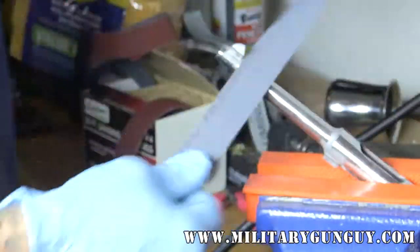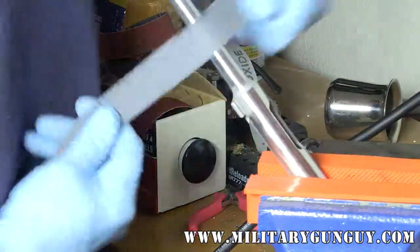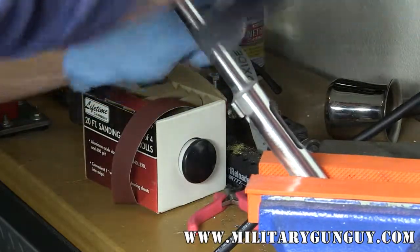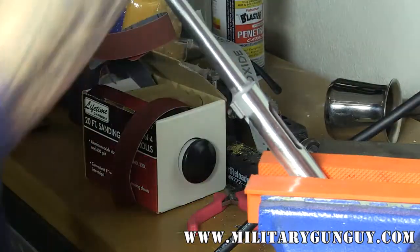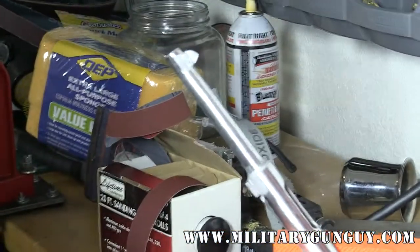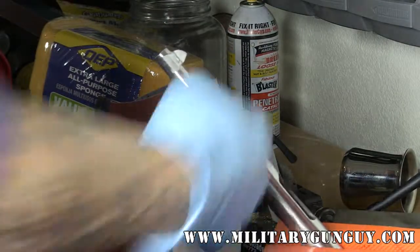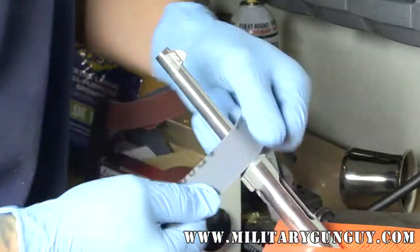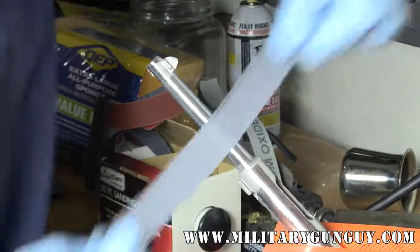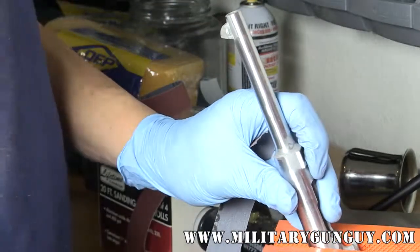Some people have asked if you can use oil on this. This is emery cloth, so you can apply a lubricating material if you like. The only thing I don't like about adding anything is you're going to have to take it off later — you want this thing as clean as possible. The shoe shine motion is going to smooth any lightly rough areas out. If you want even higher polish, you can use 800 grit, 1500 grit, or whatever other grits you can find for a progressively finer polish.